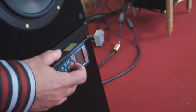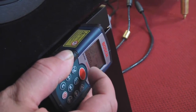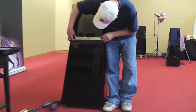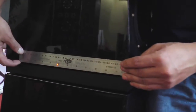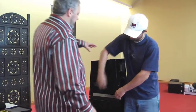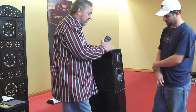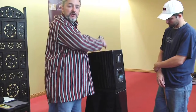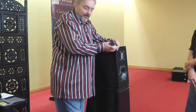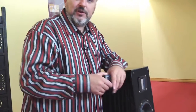You put the unit up against the face of the speaker and always make sure that it's at the same height. So if you level it to the top of here, make sure you put it in the exact same place on your next speaker when you go to do it. As we shoot across, you can see that the laser actually highlights on Mike's ruler over there and we can see that we bring it to an exact point on that ruler. You'll want to do this several times across the front of each loudspeaker. Rock them on the back corner spike so that the back corner stays in the same place and you're not going to change the actual distance from the wall. As you rock it on that back corner and start to toe it in, you're going to notice that it's increasingly hard to get the proper measurement, so you have to do it a few times to get it right on the money.